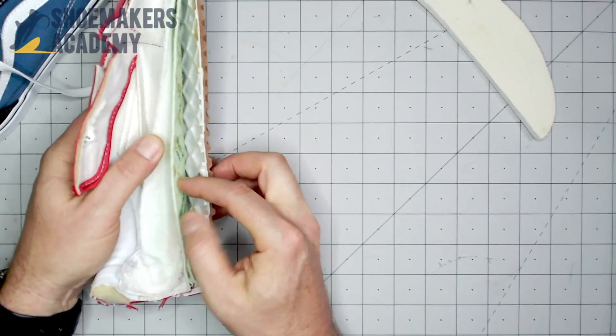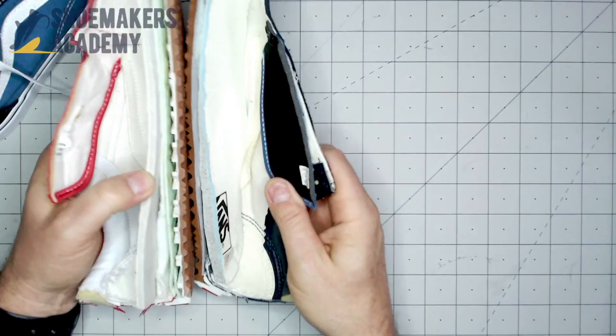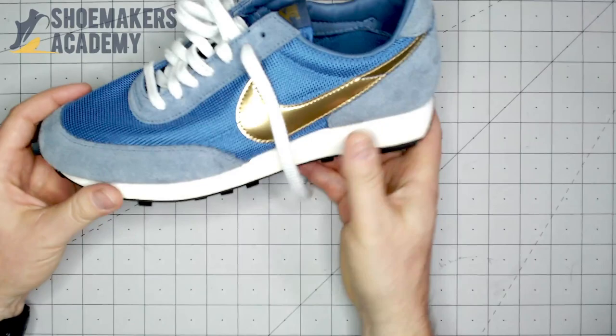You can see that it's been strobeled, and they put a little lasting board in on top to give the shoe a little bit of stiffness, because the outsole is just a regular cup sole egg crate. You can see the footbed here is just a flat piece of EVA — there's no taper to it either, which is not going to give a great standing position, whereas the real one actually has a little wedge so your heel is lifted. So here is a shoe that should be board lasted in the original, and they've made the fake strobel.